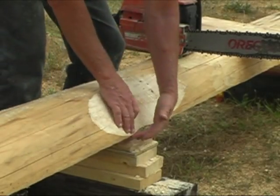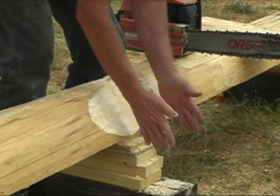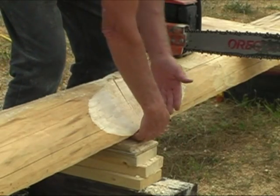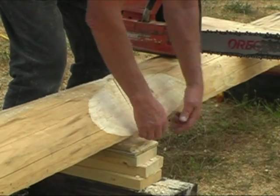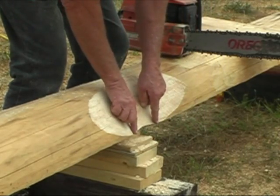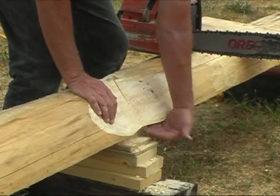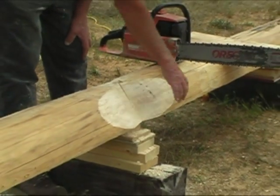Yeah, this is the side where we're out about 4 inches wide when we hit the flat. So when we fit the next log up to it, we set this up on a 1x6 so your floor can slide underneath when you put your finished floor. So the 1x6 will sit in here. When you go in here and the other log's over here, you slide under and you don't see any spot of that shim underneath. You just see the finished floor.